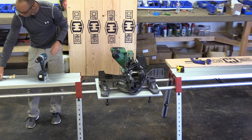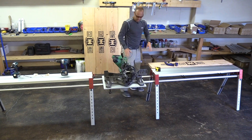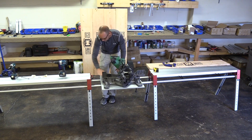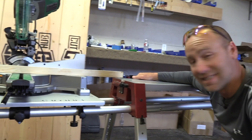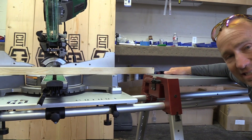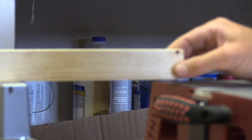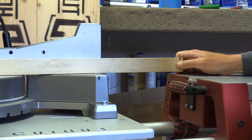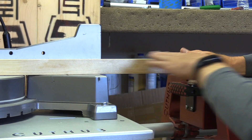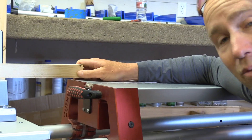Now your saw should be ready to roll. It's very important to make sure that this table height is above the cut hub unit height. Notice this is a little bit exaggerated, but it's a lot safer to have it here — I've got a quarter of an inch so that when that blade cuts, it has somewhere to fall safely. Make sure again, the height of your table needs to be above the height of your cut hub unit by at least one eighth of an inch.